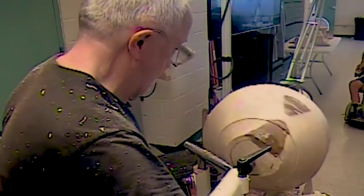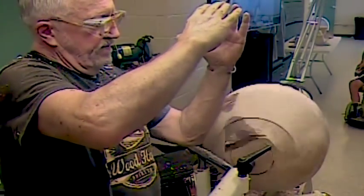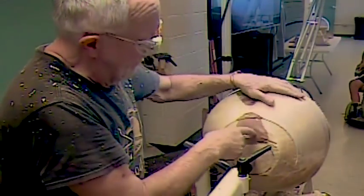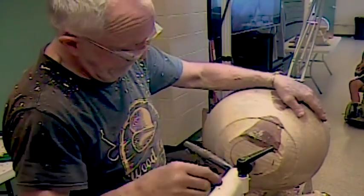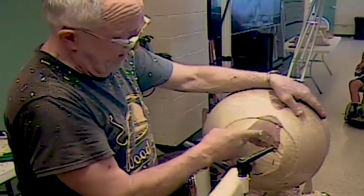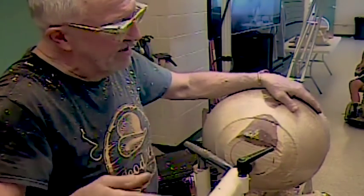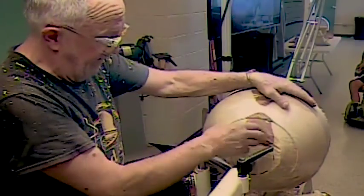Maybe not, though, because the wood wasn't nicely round on top. It was more like lopsided. So I got bark on one side. So before we get down where there's enough diameter for the crown of the hat, we're going to be down here somewhere. And this bark, I'm just going to waste some wood away now. There's no sense leaving a lot of wood on top that we have to take away later when the hat's all thin. I'm going to get rid of some of that wood now, just because I have to with that bark.